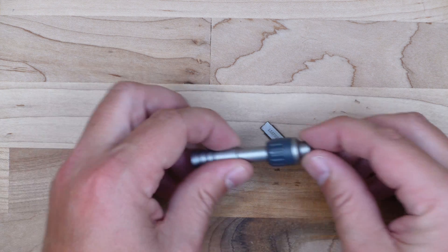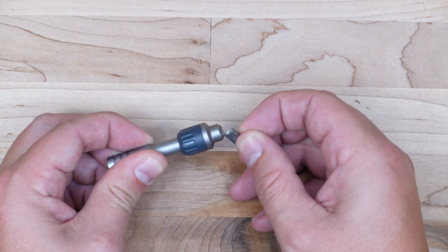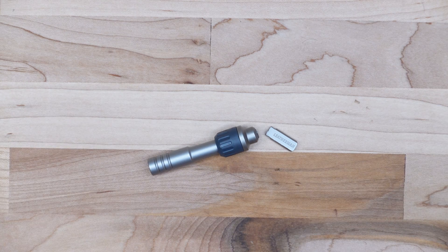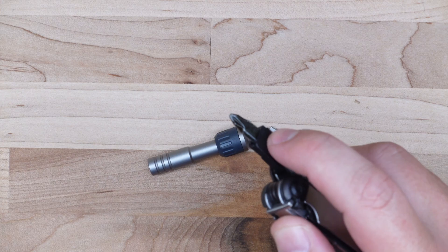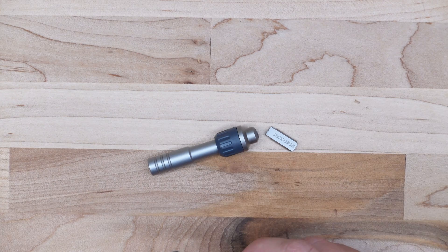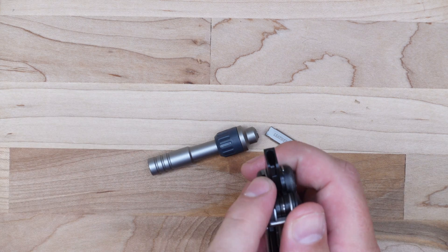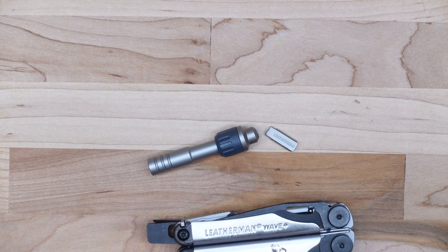I had a surprising result — I thought the ratchet itself was going to break, but I ended up breaking off the tab on the ratchet. That got me thinking: we're doing this destructive test on the ratchet, but if the bit adapter and the multi-tool itself can't handle that much torque, it doesn't even matter what the ratchet driver will break at. I'm suspicious this bit adapter isn't going to be able to take the 300 inch-pounds that sheared off the tab on the ratchet driver.